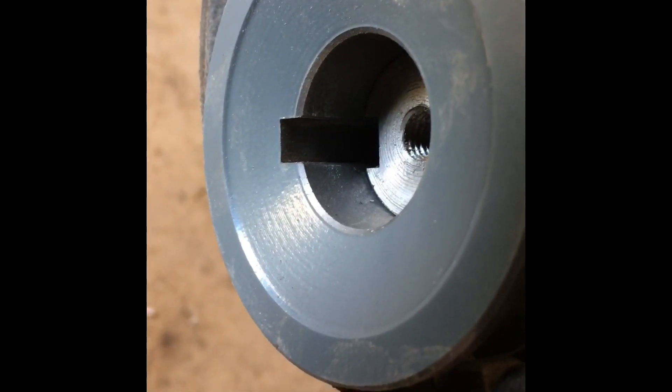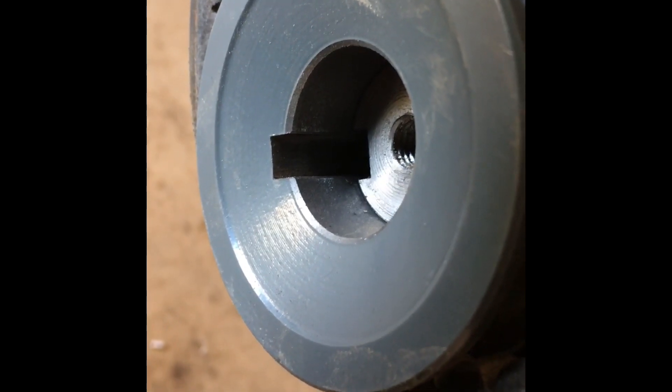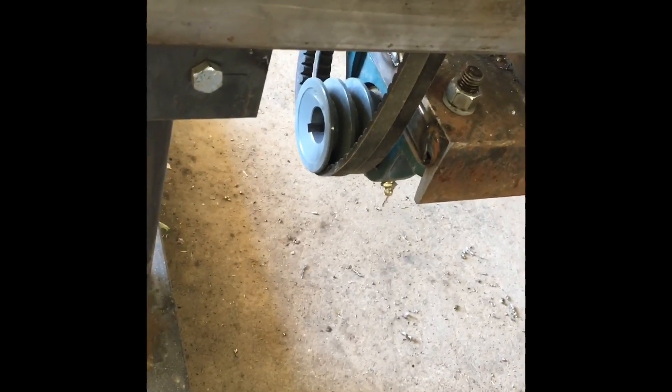It's kind of hard to see, but the slot on the planer head is just a touch bigger. The planer head slot must be like 5/16ths I think, and then the pulley is quarter-inch, so I'm going to have to see if I can locate a stepped key.